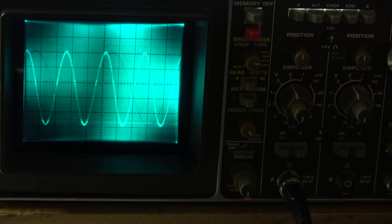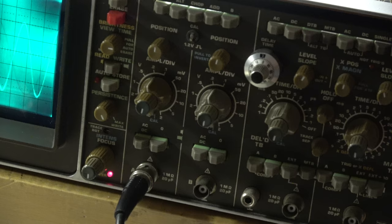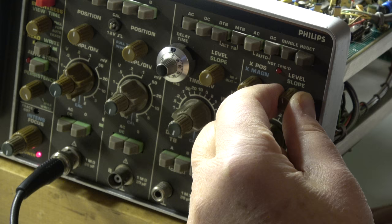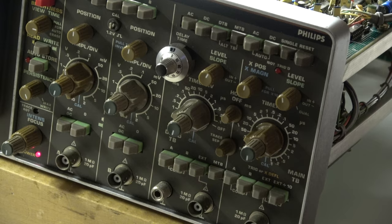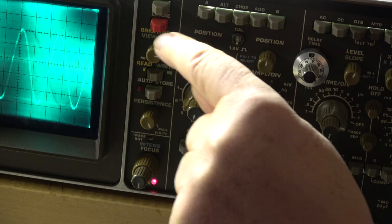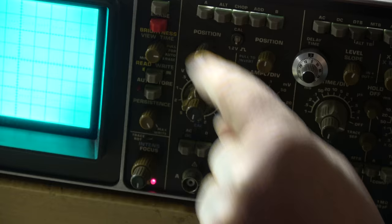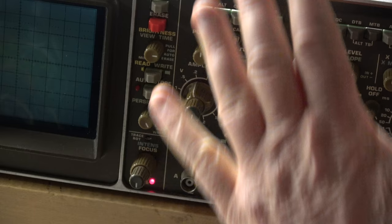In general the scope is okay. I've identified contact problems with some knobs: one knob pulls out very easily but pushing back in is hard — there may be a mechanical switch problem. Some pots are very sensitive for the erase function when touched. It needs cleaning of all contacts. And the next topic will of course be the blue capacitors.